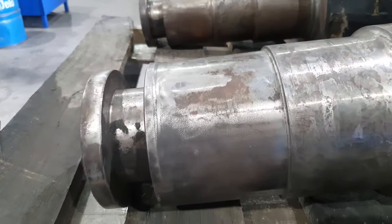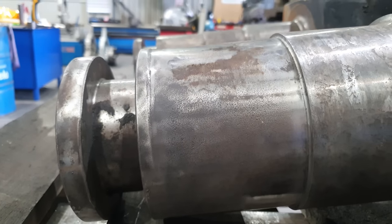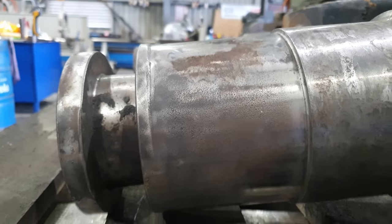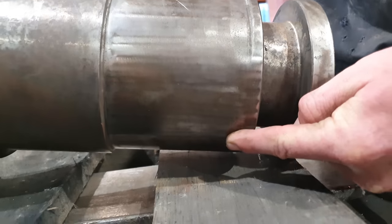That's pretty much what's happened here, but the damage on these yokes is actually caused from the machine carrying its blade, not from the digging forces. And I can tell that because the wear is on the top of the yokes. If it was on the bottom of the yokes, that would be done through standard operation, pushing material or pushing rock. But because it is on the top, it's because it's been carrying its blade.